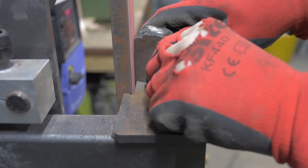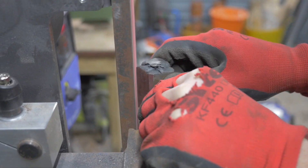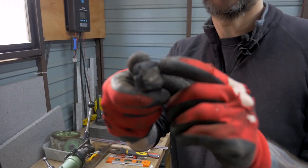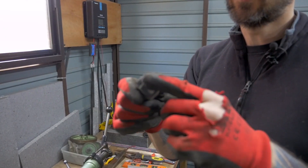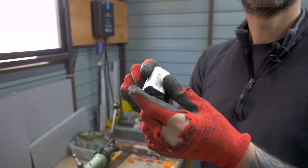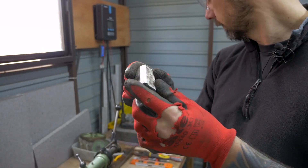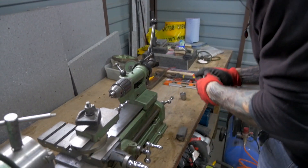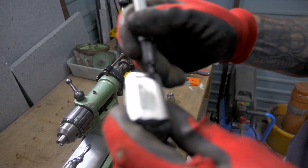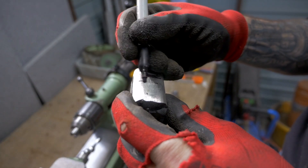I'm just going to take a little bit off the edge. I'll just take the edges off my piece of Damascus. There's obviously a rough end here and then a flat end here. I'm going to put the rough end into the chuck and then turn it so it's circular. I want to do about half of this length because I want to get two rings out of it. What I'm thinking is a ring will be about that sort of size, so two rings will be around there — we'll probably turn it to about here somewhere.